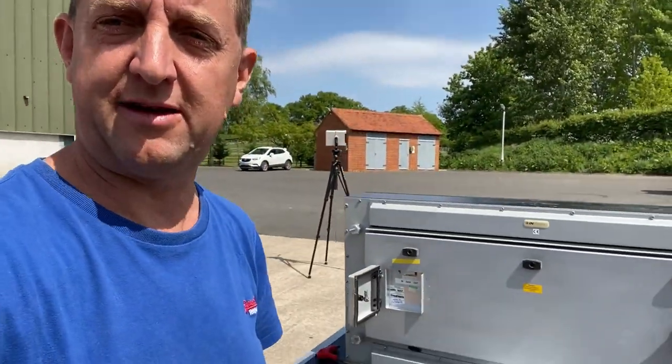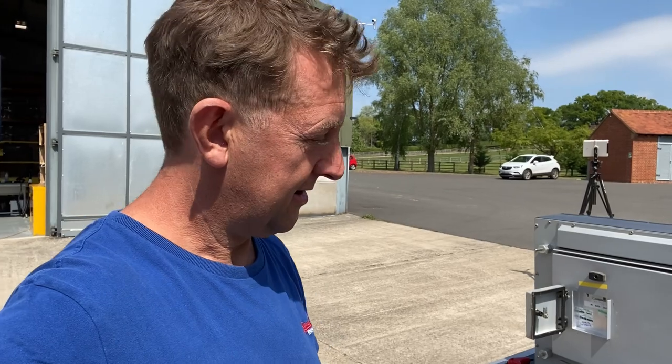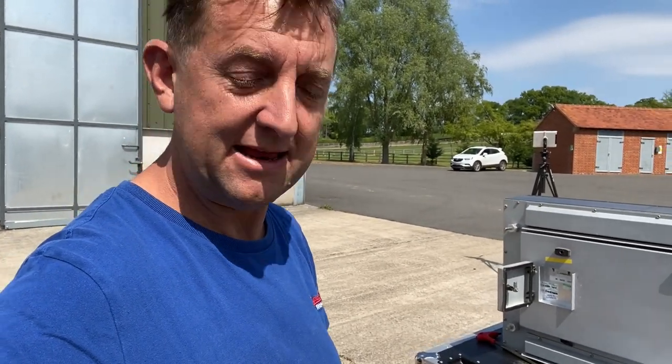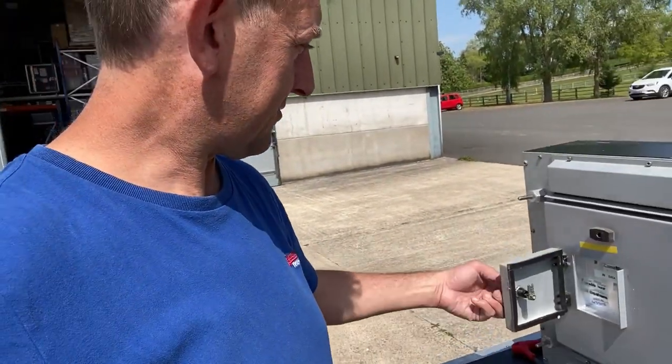And Invision chose to use a plastic fibre optic because it was very robust, very cheap, and so easy to work with that if you had a bust fibre, you could actually re-terminate it in the field with nothing more than a Stanley knife blade and a pair of pliers. It was great stuff.